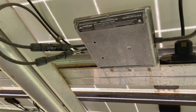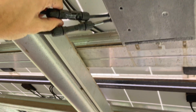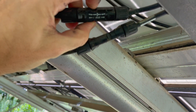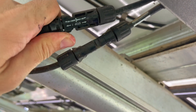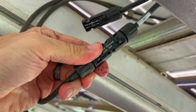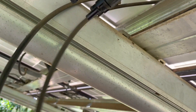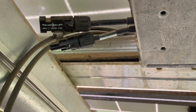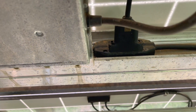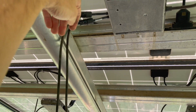With the power off, there's really only a couple of connections to these Enphase micro inverters. You've got your connections here, which you pinch on the side to disconnect. It says do not disconnect under load. So we got those two disconnected off there for the panel — and that's it, because this still feeds into the trunk line. The panel has just got those two connections.